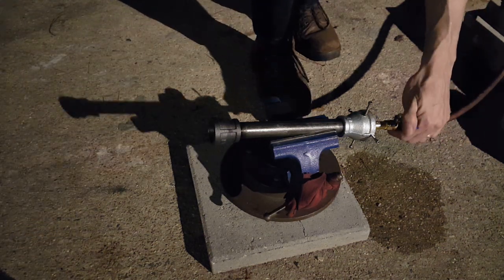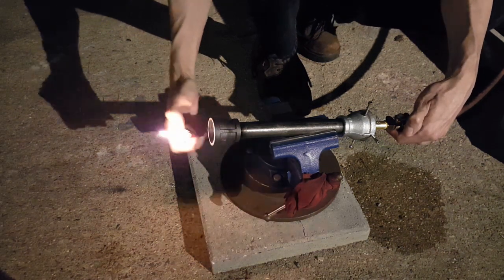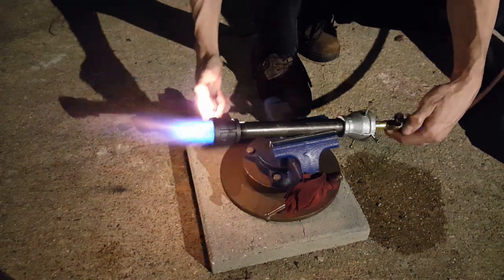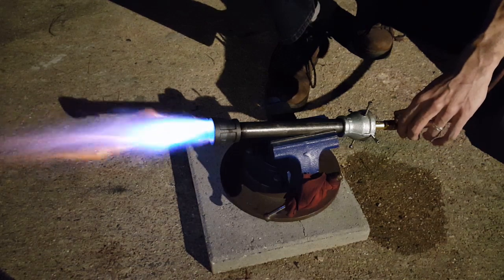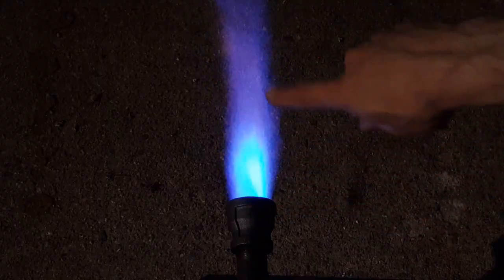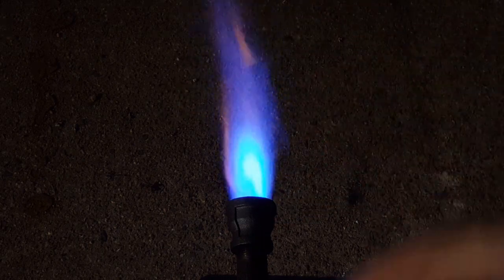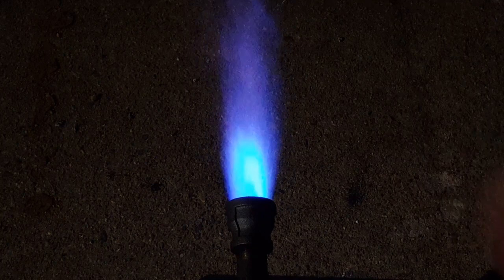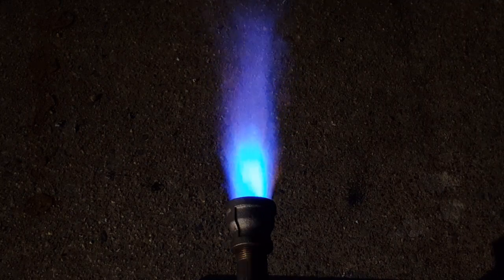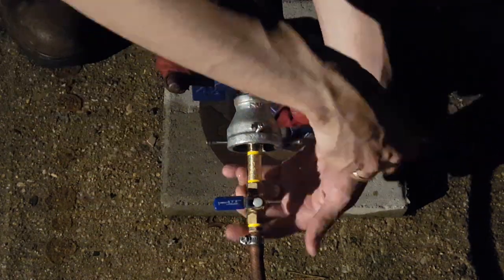Once we've checked that there are no leaks, we'll very gently light it up. Open the valve just until you hear the hissing of gas. This unevenness of the color here — it's brighter on this side, darker on that side — means that my fuel is not coming straight down the pipe, so I have to adjust the little injector. That's what those little screws are for. Now we've got an even shape on the flame — that is much better.